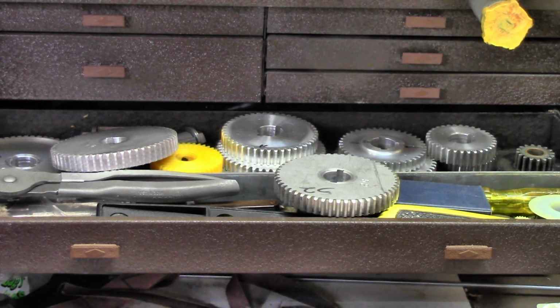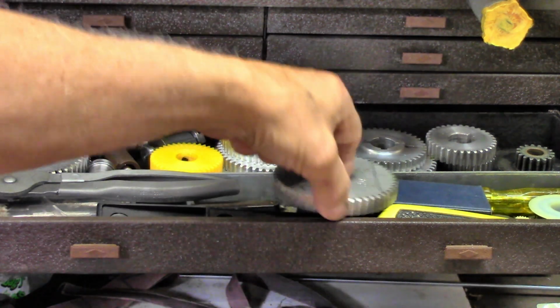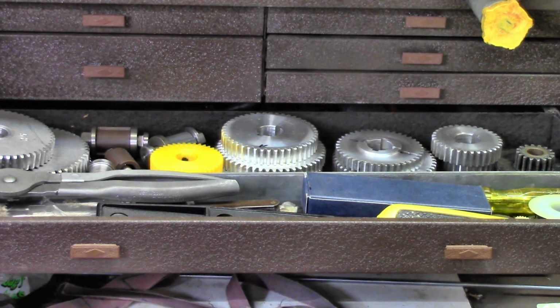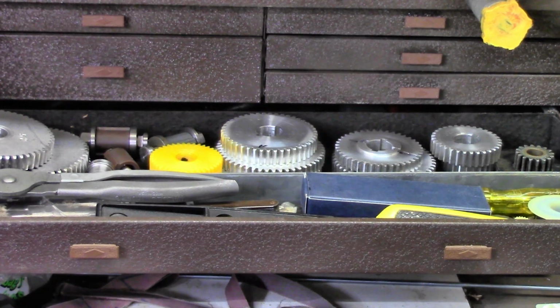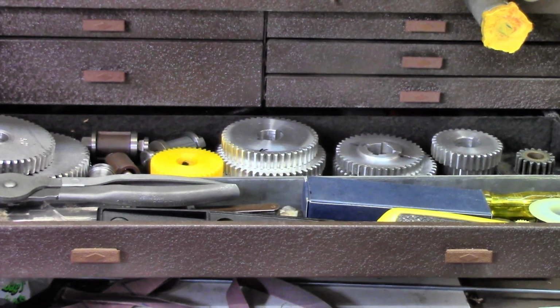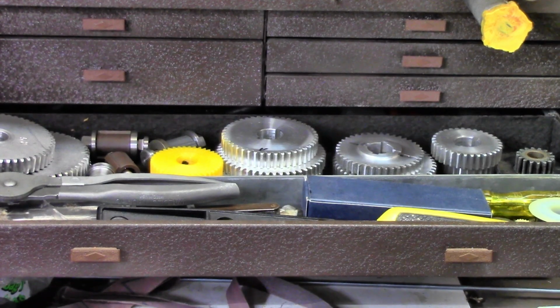and there's quite a lot of them. Let's see, that's 3 gears there, 6, 9. I made 10 gears for the Craftsman lathe, and for the demonstration I cut a 1.5 millimeter lead in, I think it was about a 13 millimeter, 12, something like that, bolt, and it works just right with a factory made metric nut. So I was really happy with that. I rarely ever have the need to cut metric threads, but I enjoyed making the gears and setting the lathe up so it could actually use them.